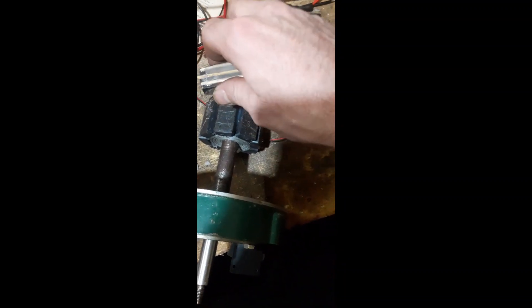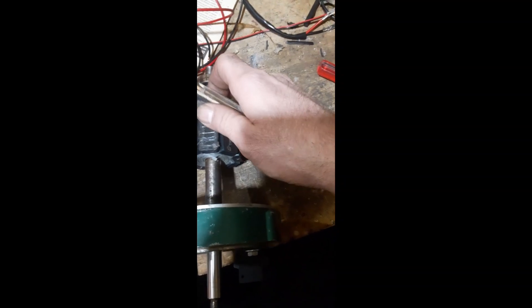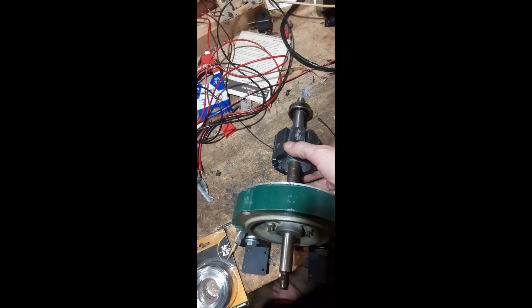This is what the magnets look like when they're on there. You got another magnet, four attracts right in a row — boom boom boom boom — four and then four repels. You don't go north south north north north north north south south south south. So half the circle, half the cylinder here that this makes is north, half is south. That's the way you want to do it.